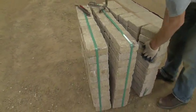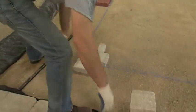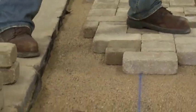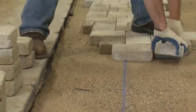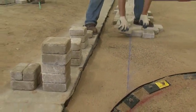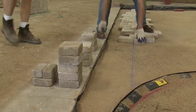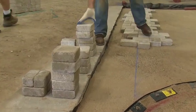So we'll go ahead and start laying our pavers. It's important, especially on a damp day, that you use some kind of hand protection — whether it be tape or gloves — it will prevent even the most calloused of hands from getting torn up by the pavers. One important thing to notice when you are doing a random pattern is you don't want long continuous bond lines. You want to break your bond lines occasionally.